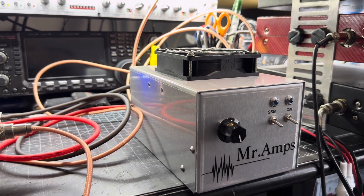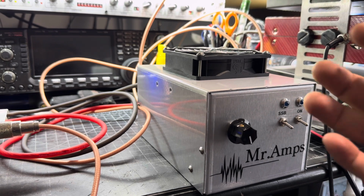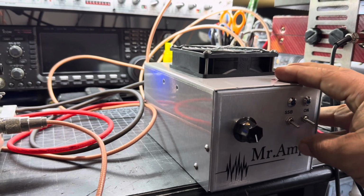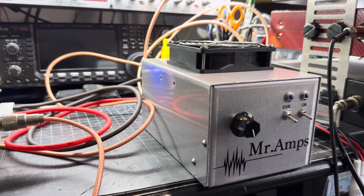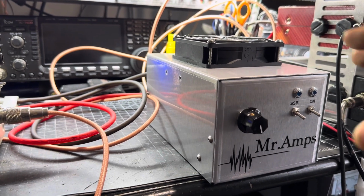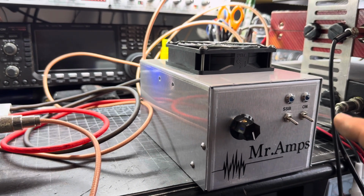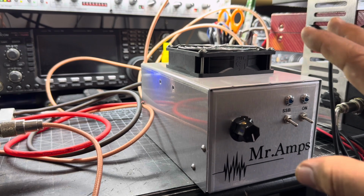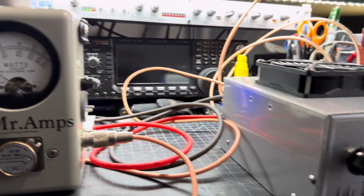The higher the voltage, the less current we're going to get, right? But use this amplifier at 14 volts, and if you're going to put it in a semi or in a car, it's 12.8 volts. I think that's acceptable, but going above that, I don't think is good for the amplifier. So I hope someone finds this information valuable to give more life to your amplifier. Just because you're overdriving the amplifier, don't expect to see more watts on the meter. No, it's not how it works.